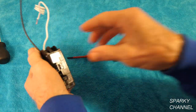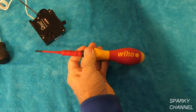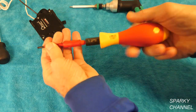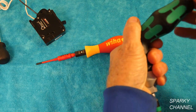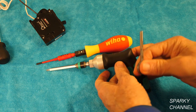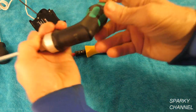You do not get as good a torquing with this screwdriver as you do with the pistol grip. The pistol grip is really nice at the end when you're doing that final torquing — it gives you extra power. But this one is better when you're just screwing it down; the pistol grip is not good when you're just tightening something down. Also, I just noticed the bit flew out the back — so that's not ideal. It usually stays in pretty good, but I was screwing hard and it flew out. You don't want to lose that.